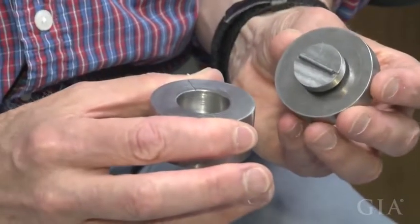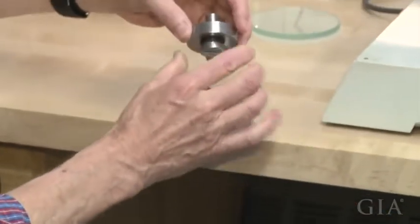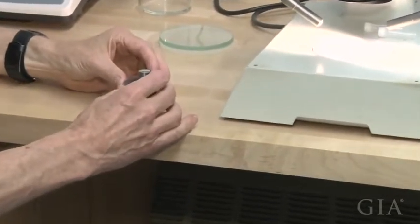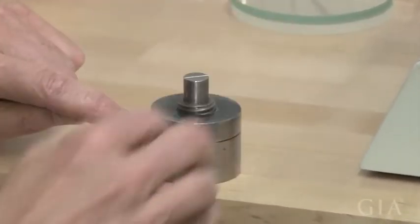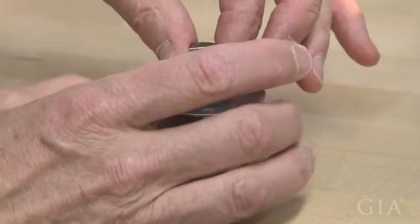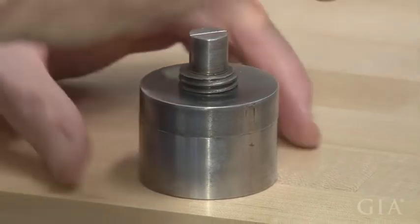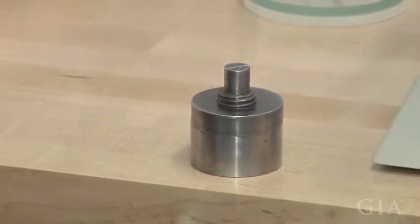There's a little trick here — you don't want too much distance or you'll crush the diamond. So this is built with loose, loosey-goosey threads. You can see how it wiggles. What we do is put this down in position — you can see it's riding on the diamond and holding the plate up. We hold it steady so we don't move the diamond, then turn it down to take up almost all the slack but leave a little bit of play.